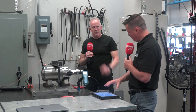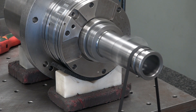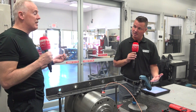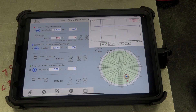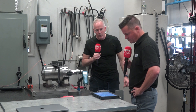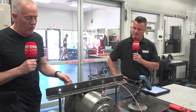Screw is in — we're launching. Now I wait for the spindle to come up to speed. We're probably going to see that little red spot is not as far out in the polar plot as the first time. And it's not — there's a big green area now. We're in the tolerance range, but we want to get even better. Hit the number two button to collect our trial weight data, then I'll shut the machine off. That's taken another data reading with the trial weight, and the next line should tell us exactly what to do.